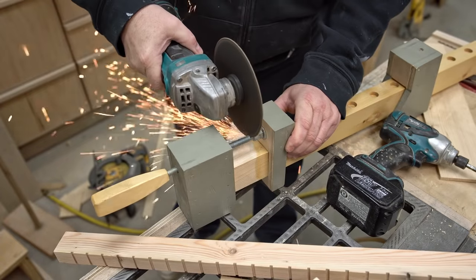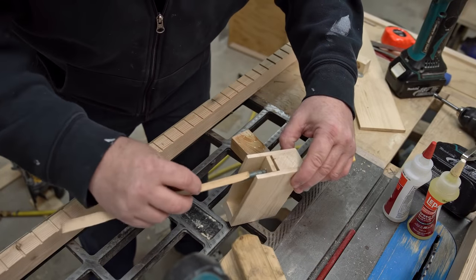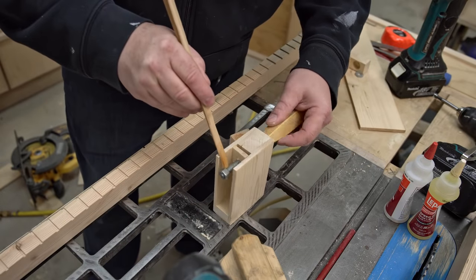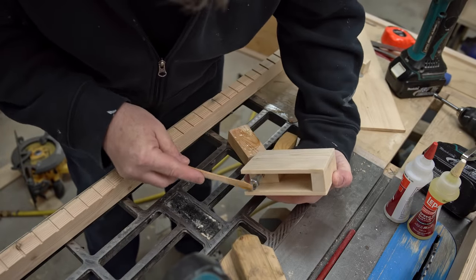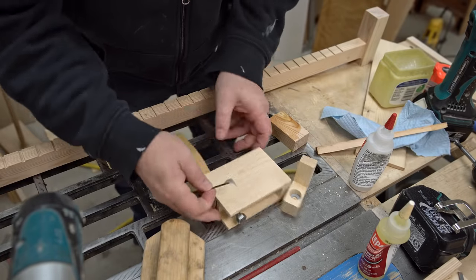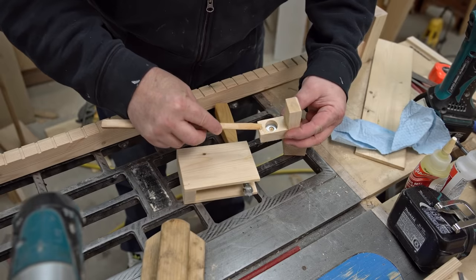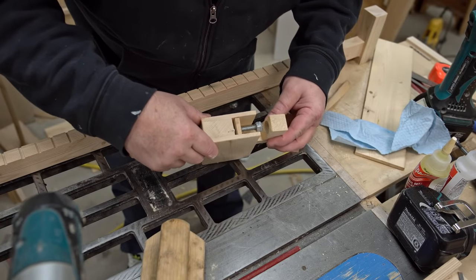I'm going to cut the threaded rod out of there — it'll thread right into the piece I've already built. I'll slip the piece of wood that holds the clamping jaw in place on there before I put the nut in place. To hold the nut onto the end of the threaded rod I'm just going to use epoxy and let that set for about 20 minutes. Finishing this is just a matter of getting a quarter-inch washer into the hole of the L-shaped piece for the lead screw to rub against, putting a little Vaseline on the end of the nut to lubricate it, and then gluing that L-shaped piece onto the retaining plate.